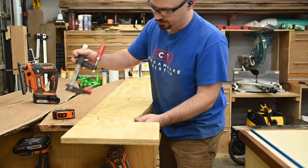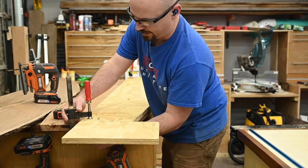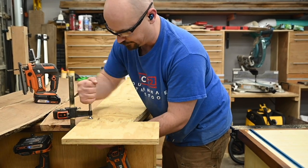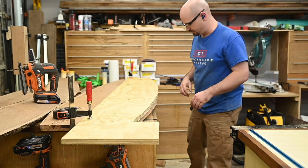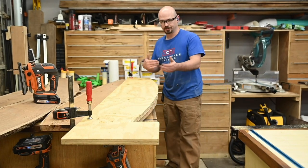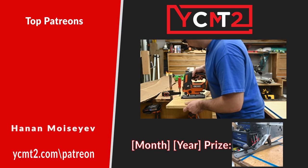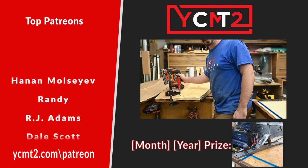Unfortunately, what counts here isn't that anything's lined up, just that the plywood actually overhangs this a little bit, because now that it's rough cut, I'm going to use a template bit in my router to follow that up and get these perfectly in line. Well, why jigsaw it? Just so the router has to take off less material. That was stupid. Fixed it.